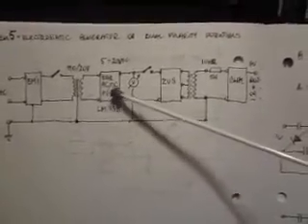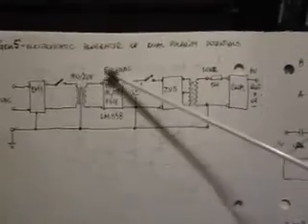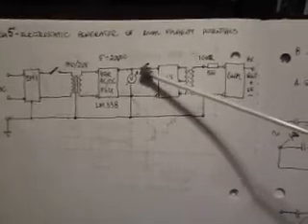I use a variable adjustable AC-DC power supply based on the LM338. Depending on the output voltage from the transformer, this will operate from 1.3 all the way up to 30 volts. In my case, all I need is 5 volts, and I'm getting around 18 to 18.5, which is fine. I have a voltmeter so I can adjust my voltage before connecting the ZVS and the high voltage part of the circuit.